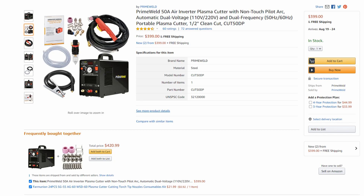This machine will do everything you need. Typically you're going to be working with something like quarter-inch 1084 steel — this machine has plenty of power and will make a clean cut on half-inch. Keep in mind, that's when used on 220. This machine is dual voltage, so if you don't have 220 in your shop, you can hook it up to 110 with the pigtail adapter and cut up to quarter-inch. It really helps to have 220 for all that power, but if you absolutely don't have it, this machine can still work on 110.